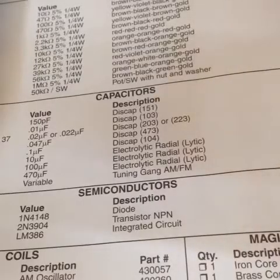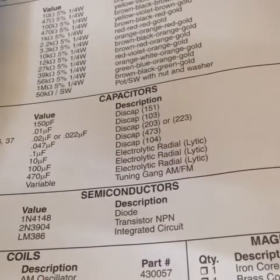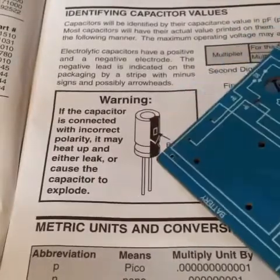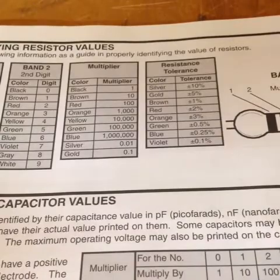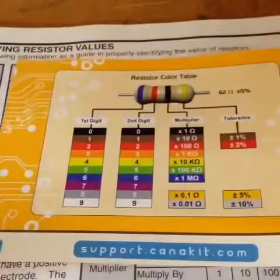Just opening this manual, on the first page you will see all of the AM radio components required to assemble this. And then later on another page you can find all the FM radio parts. Here's a little warning for the electrolytic capacitors — this black stripe indicates the negative side, and if you connect it the wrong way it might explode or leak. Here's a resistor value chart, but I prefer to use this one because it's in color. It makes it a lot easier to follow.